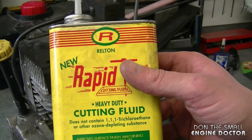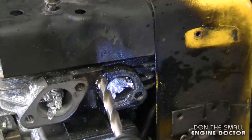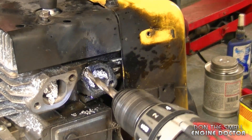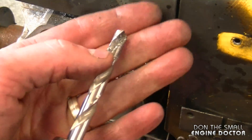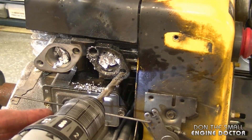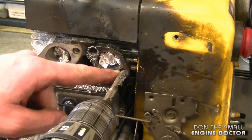It's not a bad idea to add some cutting oil on your drill bit. Now when you do this you want to drill as straight as you can. Here's how deep I am into that hole — just about less than an inch. Now I'm going to drill the next one; this one should be easier because there is no bolt left in there.